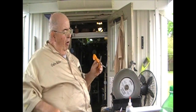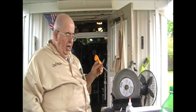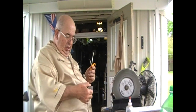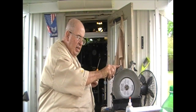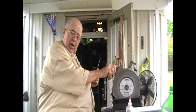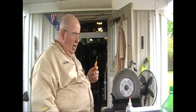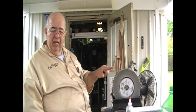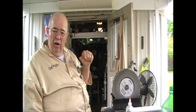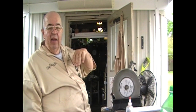Now, if I want to true it back up again, I'm going to go back to this. I've got a stone they call a grading stone. Got a real fine side that I can knock a little trash off with, and a coarser side to freshen it back up. The key is, this has got to be dead flat. So if you're grinding wrong and you put dips in it, you've got to true it back up again, and then make a jig for doing that.